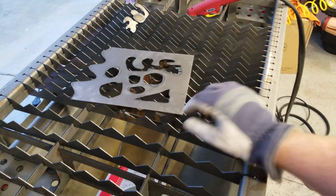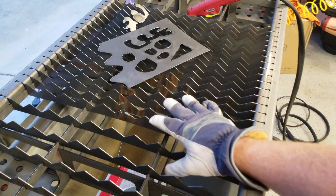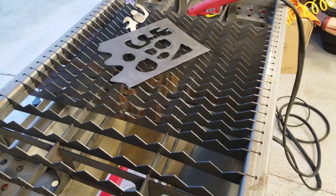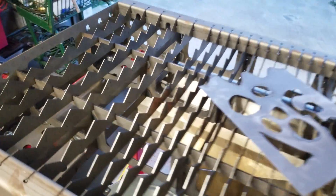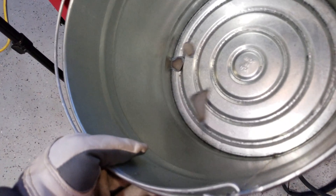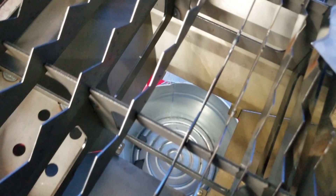It's a good thing I've ordered some additional slats. As you can see, it does kind of burn through those — which, by design, these are considered consumable parts, and they're very cheap. The slag bed definitely seems like it's working. I can see the cut pieces that fell out, and you can also see that black dust generated when you're cutting — that is all down in the bucket. I'm going to call that a win. Everything appears to be working perfectly.